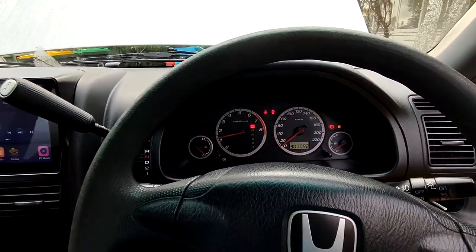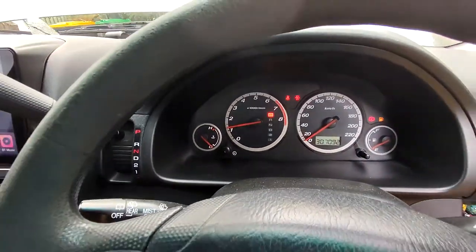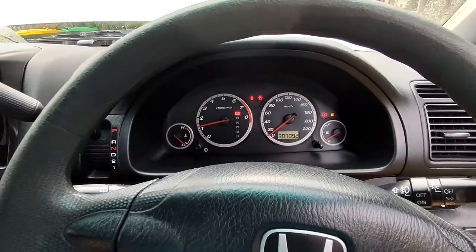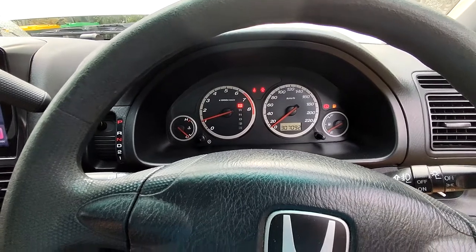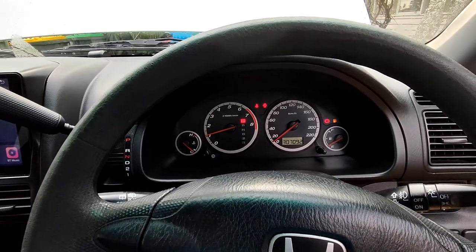So to me that pressure switch also detects how much gas or refrigerant you've got in there. I'd say right now I may have a slow leak on my system - but at least I know my compressor is acting exactly as it should. One other thing you can do is test the compressor wiring.